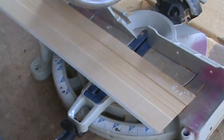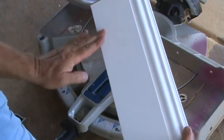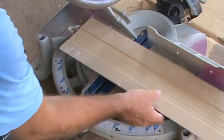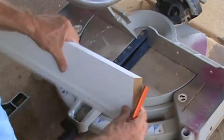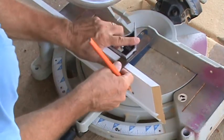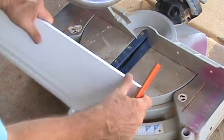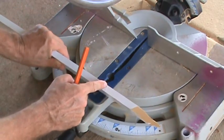Let me show you a couple more things here. Put the mark on the back side — got this little piece I'm going to use right here. This is going to be cut at an angle, so I could flip it around like that. I got this two-inch piece and I don't really want to cut myself. I know that's a square line, so I can put my square right there if you don't think you can eyeball it. I can get it on the face — that's right where the inside cut's gonna be.